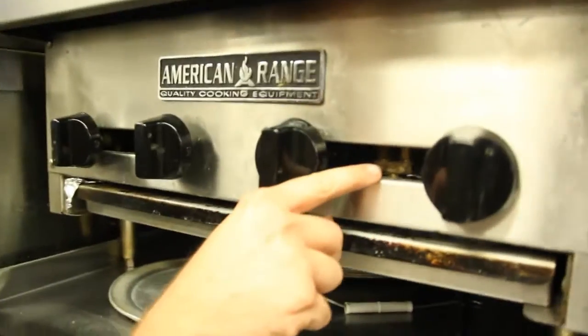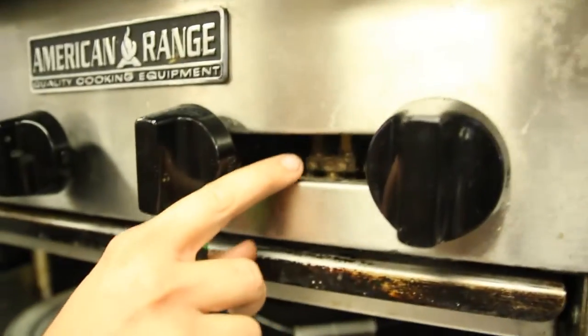What you're looking for — if you see deep inside the unit here, there's a pilot flame. What you're going for is very little to no yellow in that pilot flame. You want it to be strong enough to stay lit, but you also don't want it to heat too much or waste gas.